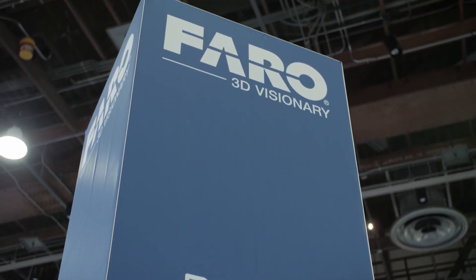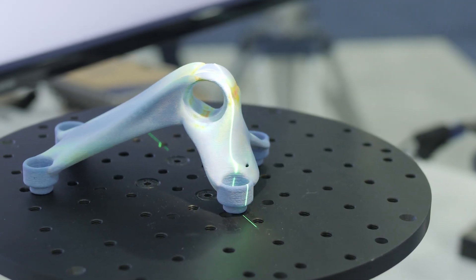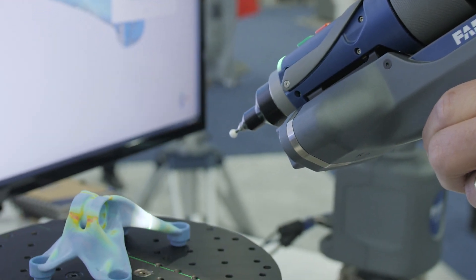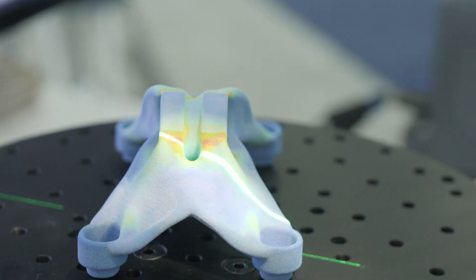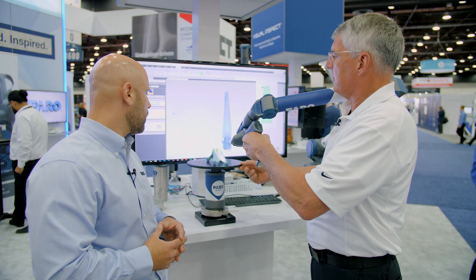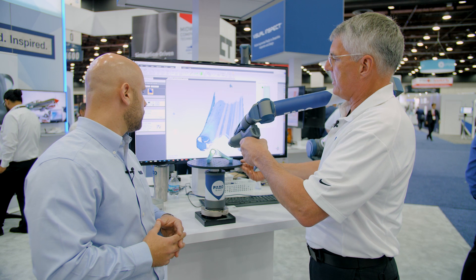Can you tell me a little bit about what you're featuring at the show? Sure thing, Mike. We're featuring our Design Scan Arm. This is an 8-axis probing and scanning device that we just introduced a couple of years ago for our 3D design vertical. Basically, we can scan in color. We have a green laser line with a thousand points, and when I hit that trigger, we're collecting at about 120 frames a second, or 120,000 points per second. Pull the green button — you'll see we're getting full color with this. This 8-axis is really nice because I'm able to just rotate it with my hand and keep scanning the part.